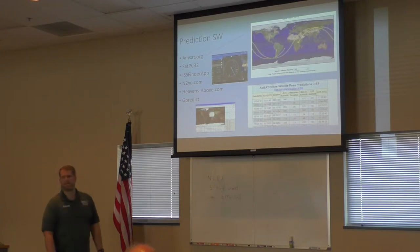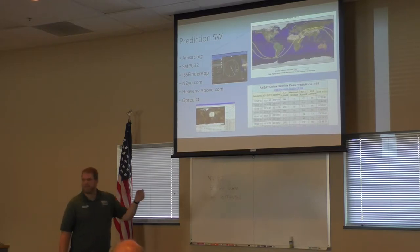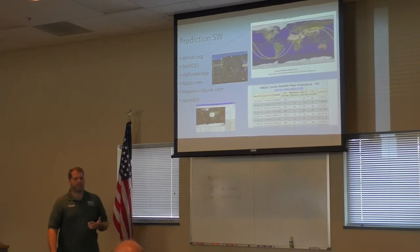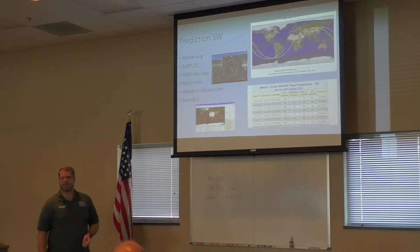So we need to predict these things somehow. I've mentioned that. What can we use? Well, there's a whole bunch of tools out there. First of all, you can just go to the web. Amateur Radio Satellite Organization, or AMSAT, has a website at amsat.org that gives you the satellite statuses. So amateurs will feed into this little database that says, yep, I just saw that satellite, I just worked it on this mode, I got through successfully, we did the following. It's good to do that just to make sure that the satellite hasn't died.